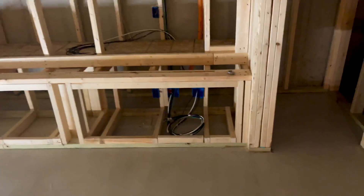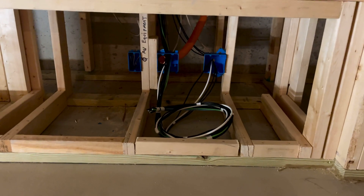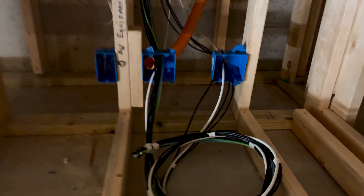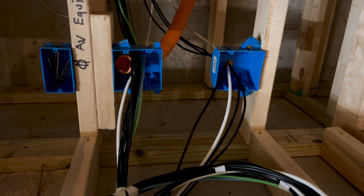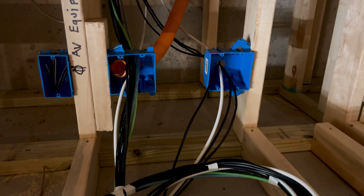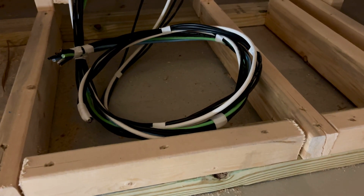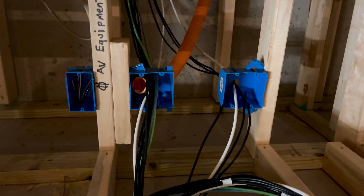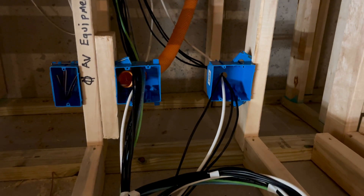This is where the equipment goes — down below, a couple of boxes to squeeze everything in. The box on the left is where the conduit ends. There are going to be two pass-through plates here — basically just a hole where the wire passes through. We don't make any junctions here; the less junctions the better. The cables will come out of the wall plates directly to the receiver — that's just one less problem to have. It'll still look nice and neat with two hood wall plates.